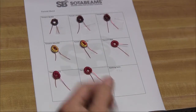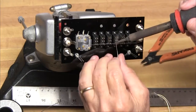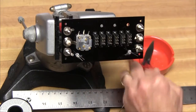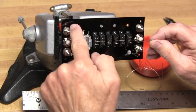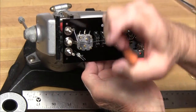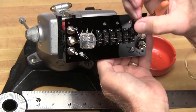All those toroids are laid out and ready to go, so now we get to do a little bit of soldering. We thread a piece of wire through all the bottom terminals of the switches, then solder them. Now we cut the wires between each of the switches, leaving just the contacts on each switch connected to each other. We slide another wire through the center terminal of all the switches. The left end of this wire will be connected to the red binding post at the top left, and the right wire will be connected to the right red binding post. After soldering all those connections, we cut the wires between the terminals on each switch, so the switches are connected together but the terminals on the switches themselves are not.